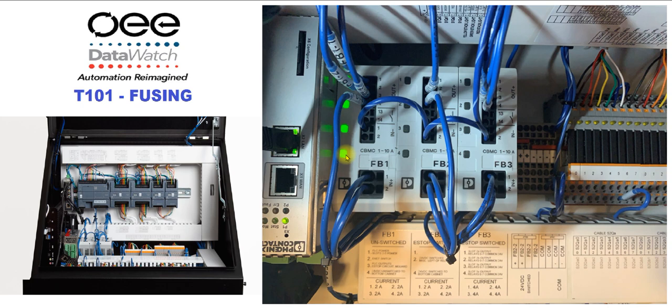To change the current for the channel, press the channel button the number of times equivalent to the number of amps you desire. Check that the flashing is equal to the desired current, and then press and hold the button for greater than 2 seconds, and then it will turn green. You can also toggle this button on and off to turn that channel off if you need to do maintenance.